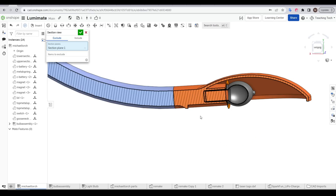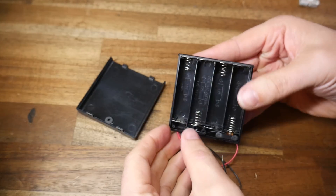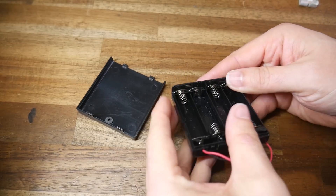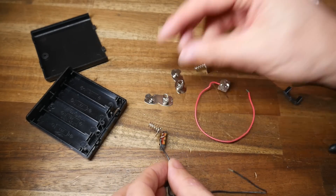There's also a distinct lack of detail on how the gooseneck would attach to the bulb sub-assembly, so this would need a redesign. The main reason the detail wasn't in place was because I never sourced the actual electronics or hardware — so let's start there. This rendering shows most of the components I need to find. Here is a spare AA battery case, just right for harvesting pre-made, high-quality battery springs and clips. To extract them, all we need to do is pull on them with pliers. These can be cut into smaller segments or soldered into larger ones as required.